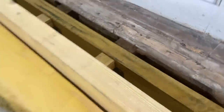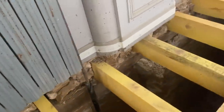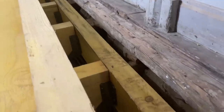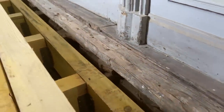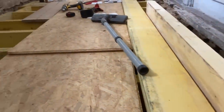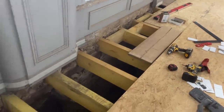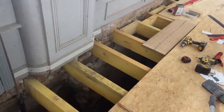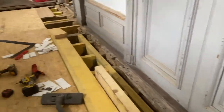I've pulled out all the existing beams out of the wall over here, and then I can just put them all the way along with the hangers. It's good for me because this beam I'm touching here is absolutely level. So as I put the joists across the width of this hallway, they are absolutely level. At the moment I'm going through and putting noggins in, then I can work out the distances I need to put the OSB board down with the parquet on top — so as I've done the other floors, it then marries up with the face here. Touch wood, we'll see.